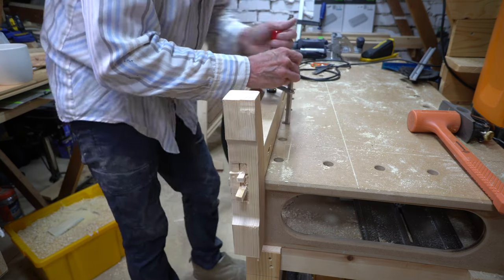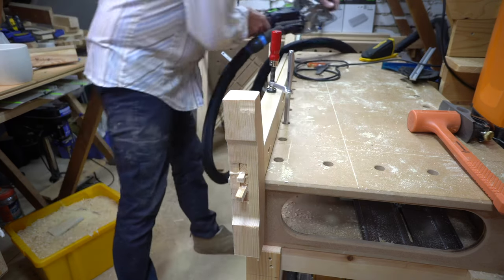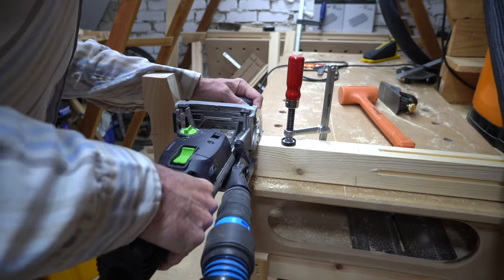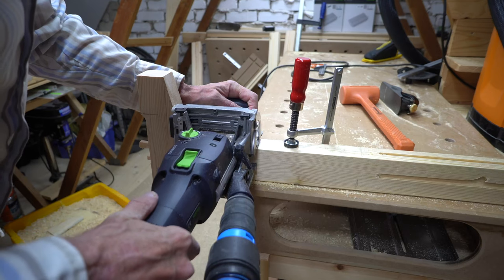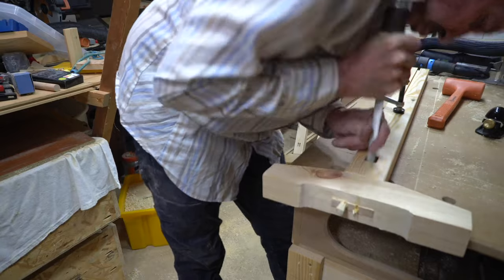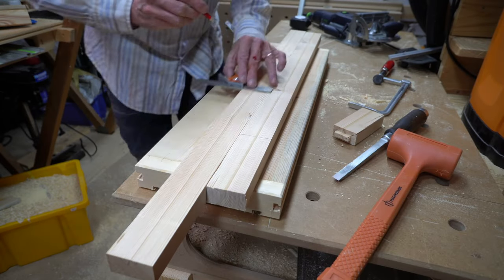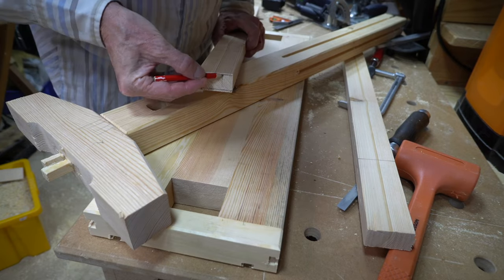To cut the four mortise pockets, one at the bottom of each leg, I figured I could cut the mortise pockets with the domino by cutting from each side and then reversing the cuts, so four cuts total per leg. These mortise holes just then needed minimal clearing out with my mortise chisel. Of course, I could have cut these fully with the chisel or drilled them out and then just cleaned up the mortise. And now my mortise hole was cut, I could mark out the size of my tenon to the hole